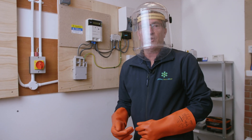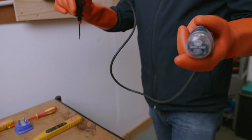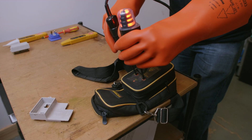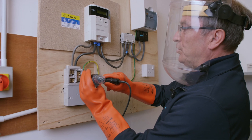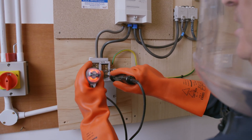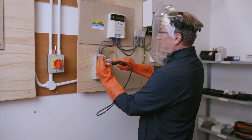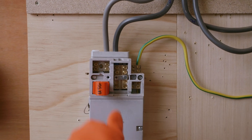The next stage is to check that you've got a supply. You want to make sure you've got the live, neutral, and earth. This is where you use your Drummond's test lamps. Make sure that your test lamps are fit for purpose. Make sure that everything's tight and that you've got a supply. Use your proving unit — so it's prove. Then you would start by using the prong on the earth, across your neutral, and then across to your live. And then again from your neutral across to your live, and then across from earth to neutral. That's now proven that I've got a supply — a live and neutral, and a live and earth. At this point, I can put in my shroud and move on to the next test.